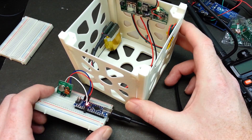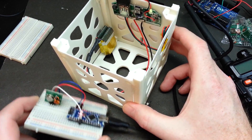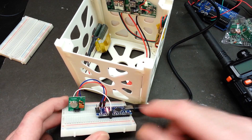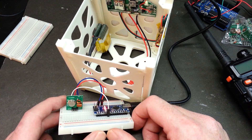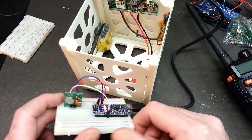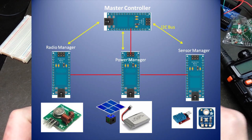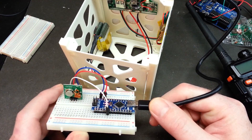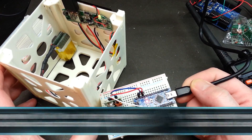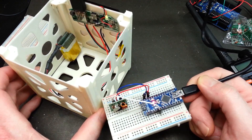Just as simple as that — with an ultra cheap eBay transmitter, an Arduino Nano, and some hacked up components, we're sending the telemetry down. Next, I'm going to add more Arduinos and data bus them together. This one will be devoted to just transmit. I may even scale it down to one of the minis — we don't need much; we can probably use an ATtiny for this. We'll data bus them together via the I2C data bus. With multiple microcontrollers on board sharing information, it's pretty exciting for cheap off-the-shelf electronics. We've now achieved a transmit module. We'll do some range tests — I suspect we're going to be about 100 yards.